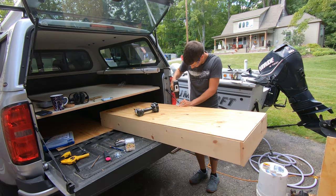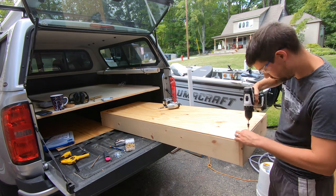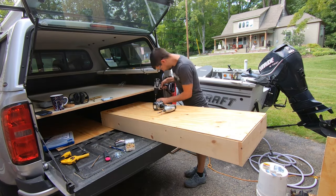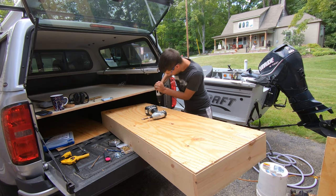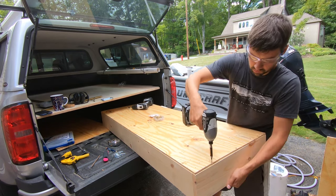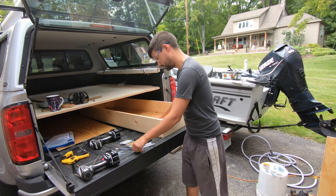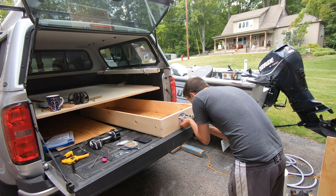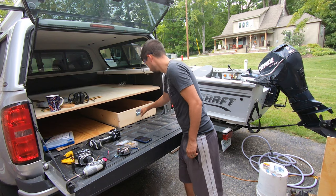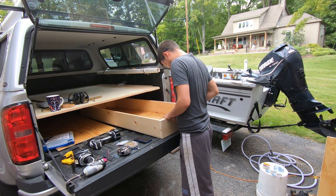I've taken the plywood and put it on the bottom, flipped it over, and I'm pre-drilling and countersinking with the same countersink tool — probably four or five screws on the sides and three or four on the ends — putting in exterior grade screws, I think an inch and a quarter. That builds the shell of my box. I'm marking the halfway point and putting in a drawer handle. I'll do the same for the other drawer. They slide in and out nice and easy, they're the perfect length, and they're not full height because I need room to put stuff in there.